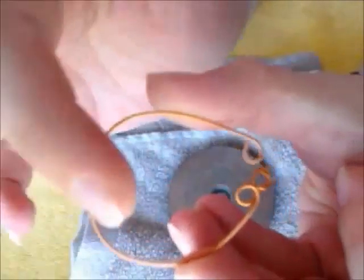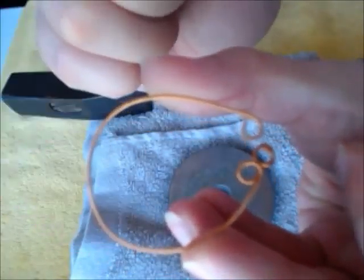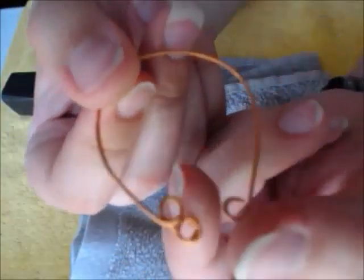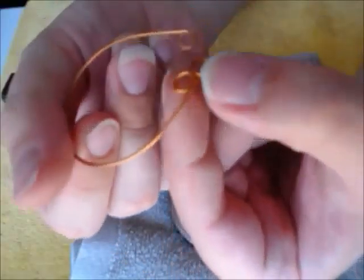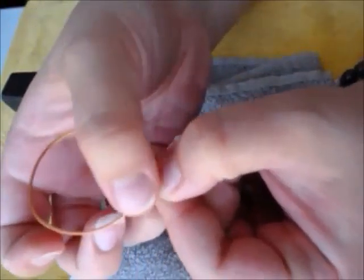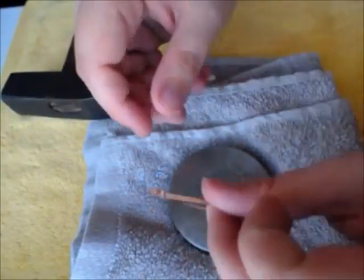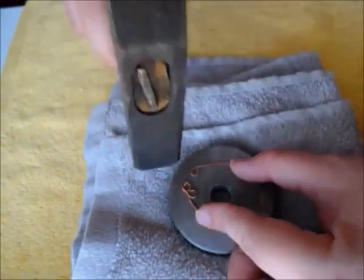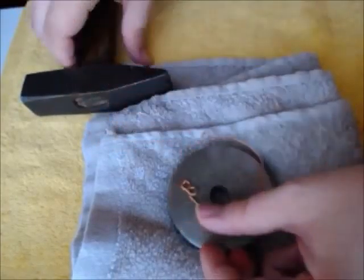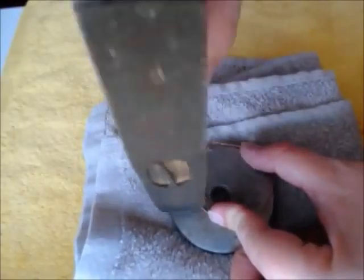If we turn to the other side of the jewelry, we see that this surface is much smoother than the side we were hitting. That's why, generally, when I'm doing this work, I hit my craft on the back side and the front side is touching the metal of the anvil — it works much better.